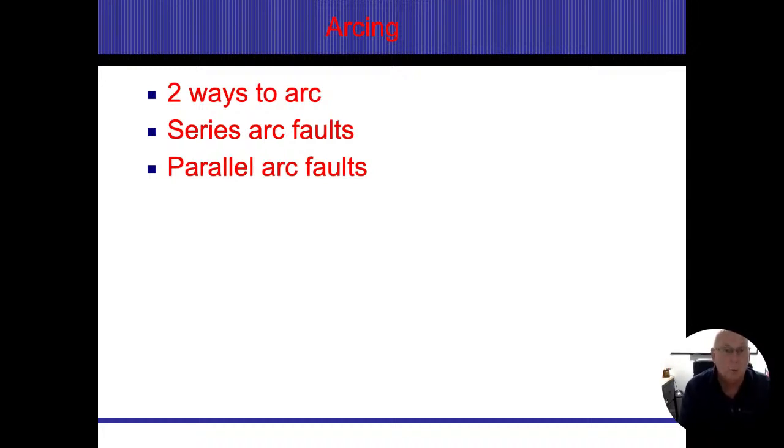What I have seen with my own eyes is that we create an arc or a fault inside this. We create an arc and sparks start flying inside those panels or inside of a switch box, and those holes are missing. Now those sparks get out of that panel, because those panels are designed to contain any sort of blast or arc or fault that happens inside of them. But if those holes are missing, now it gets out of there. If I got insulation, wood, anything else, there's a chance that it could start the structure of the house on fire.